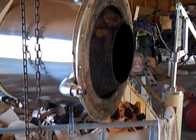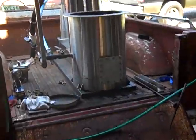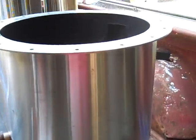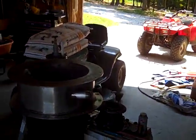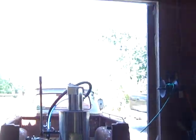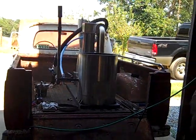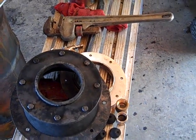Putting this thing back together shortly — can't be without the gasifier for too long. I'm very happy with it after a year of running on and off, leaving it outside. It's in real good shape. This was made not by me but by Victory Gas Works, so all credit to Ben and the crew over there. I've learned a lot about gasification by tearing it down, preparing wood, and running engines. We've run a Harley, a pickup truck, a generator, and a straight-six Ford 300. I've been surprised by the range — able to run engines from 88 cubic inch up to 300 cubic inch. Very good gasifier.